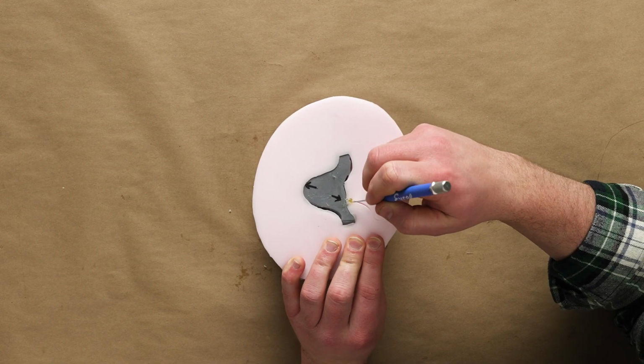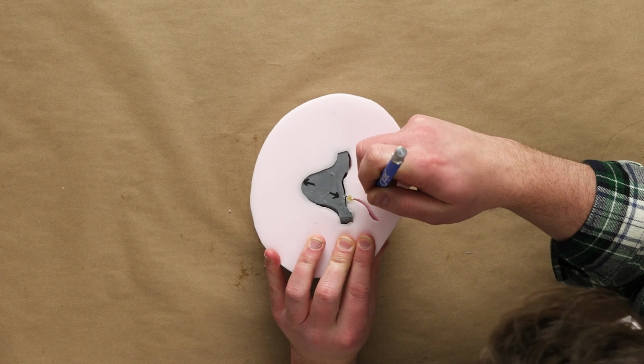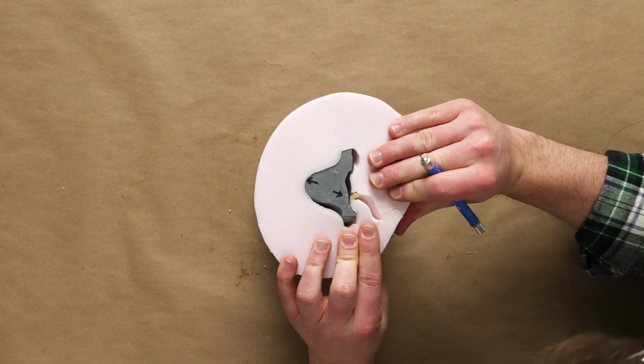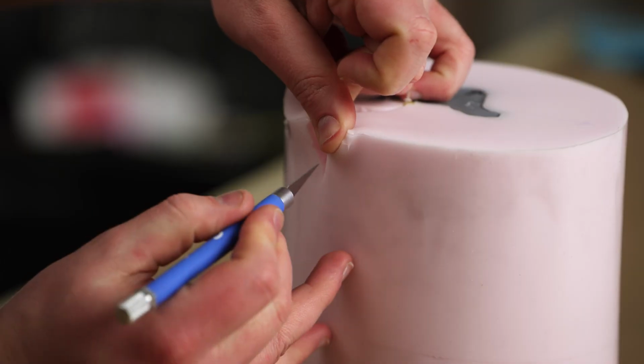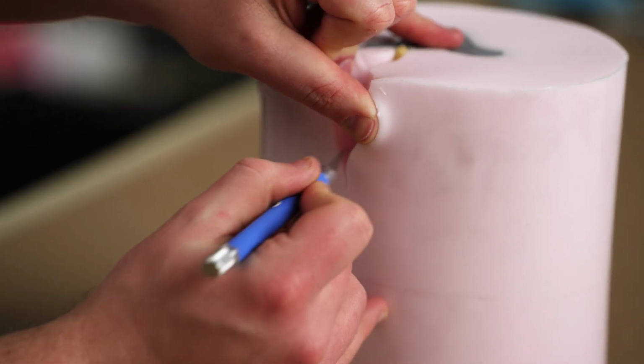After we've cut our jagged edge, we can move to where our silicone meets our master and cut a more straight line. Since our cut is straight here, the seam line we create will also be straight. Our final cuts will be slightly uneven ones that connect our jagged outside lines to our straight ones on the inside. Slightly uneven cuts in the middle will also help lock our mold together when we go to cast.